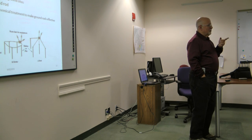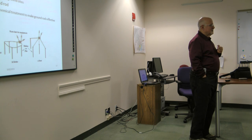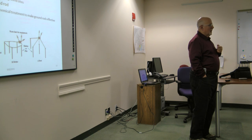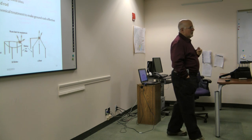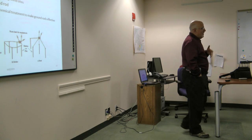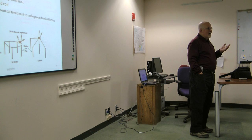I was just going to say, in my house, I have copper piping with a ground clamp on piping inside the house, going to the service panel and then out to the ground rods. Okay. So there is a continuous path from all the copper throughout the house directly to the ground, but not in every house. Yeah, not in every house. And again, the house may have been built just fine 20 years ago or 40 years ago. In the case of my house, 80-something years ago.